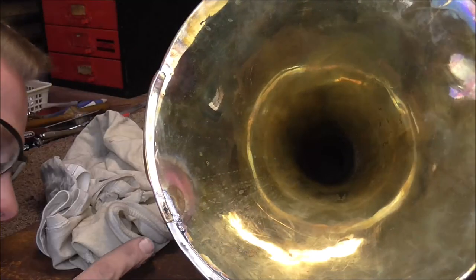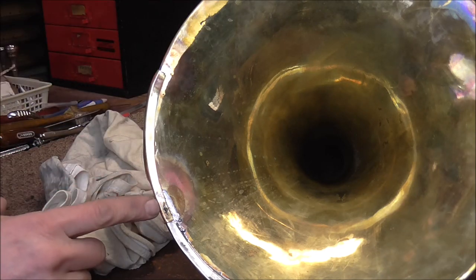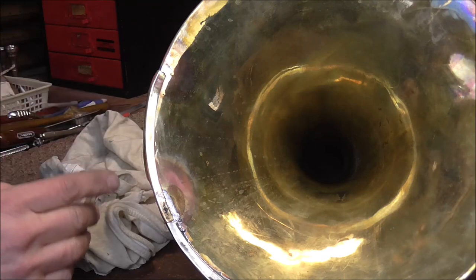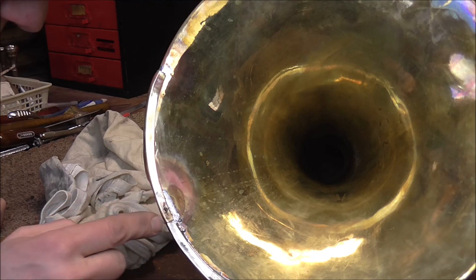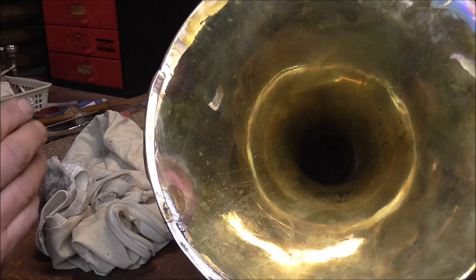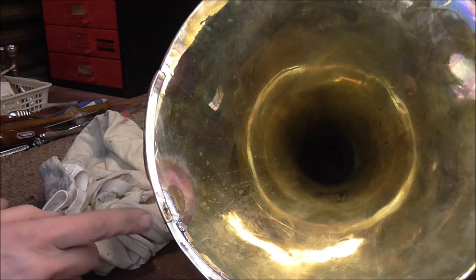The solder is hardened. I have tacked that on a little bit more, and you just keep doing that — you go up a little bit at a time. You want a very thin layer of solder because if you get a clump of solder underneath the patch, when you burnish the patch it's going to leave a big bump on there and you don't want that. So that is a very thin layer of solder underneath that. You see some solder mess here — I'm going to clean that up after I'm done. This will be a very messy solder joint so I'm just resigning myself to the fact that it will be a mess and then I'm going to clean it up when it's done. The solder is not hard to clean up so it will clean up very nicely.